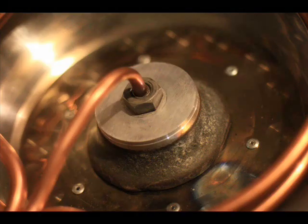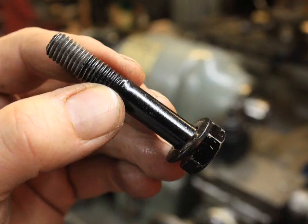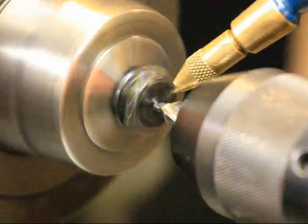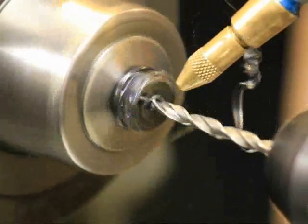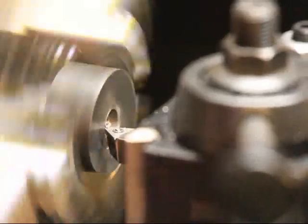Now here you'll see, and I'll just show you the machine work, that line goes into a bolt which I've drilled all the way through. See the plate and the piece of steel there? That's just to absorb the energy through conduction, and then put it all the way through to the bottom, where the idea is it will heat up that oil to the flash point and hit the bottom of the burn basket and be able to smoke, and with the addition of the air, get a clean combustion. We'll see on that. That'll be the next video when I finish off all that.